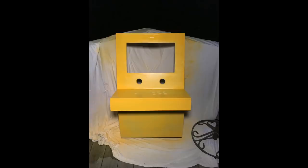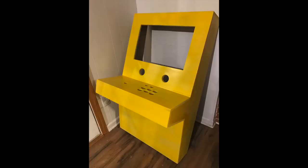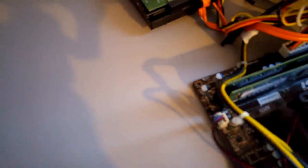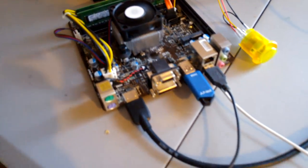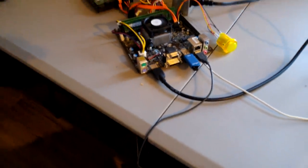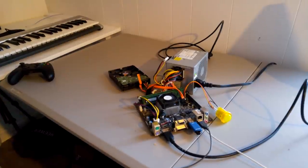When we got to the piece for the controls, I had printed out a sheet with my holes all laid out. We took a punch, punched down in the center, and used a spade bit to drill it out. Before painting we used spray paint the first go around — it looked terrible. So we switched to a foam cabinet roller and latex paint, and after about four coats it looked pretty good. The next step was to assemble the internals: a PC motherboard, 8 gigs of RAM, AMD processor. We also used a joystick button for a power button, which worked out pretty well.